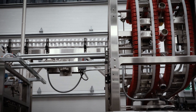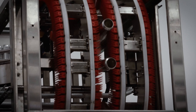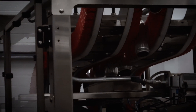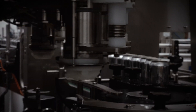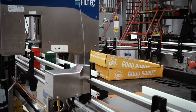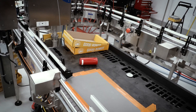There are many control parameters to be mindful of when it comes time for packaging, such as ensuring the primary package has the correct attributes and is absent of damage and foreign bodies. During a packaging run it is important to implement testing protocols at consistent time points, where product is taken from the line and inspected for various parameters, including ensuring the required volume is being delivered to each container by checking fill weights.